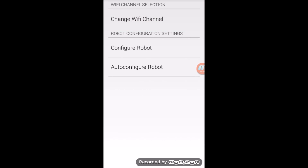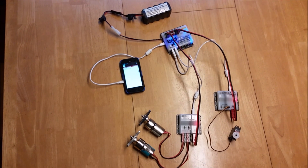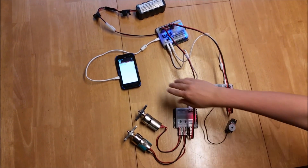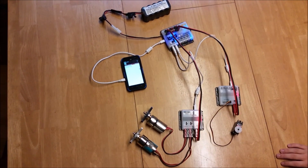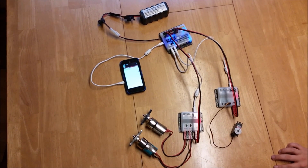Hit the Back button again until you get to the main robot controller screen. Once you get to this screen, it should say Wi-Fi Direct Enabled and eventually get to Robot Status Running. If you have any error messages, make sure that all of your electronics are plugged in and turned on and that your configuration file is accurate. So that's it for this video. We've demonstrated the basics of how to wire motors and servos together along with all of the other required electronics. We've also demonstrated how to configure the robot controller phone, and hopefully that teaches you what you need to know in order to wire and configure your robot. Check out our next video on how to run the code for your robot. Until then, goodbye!